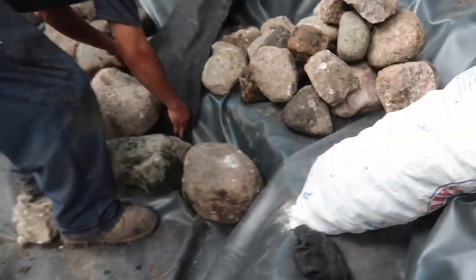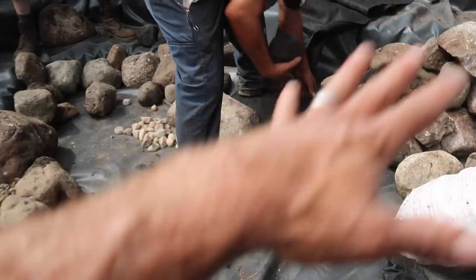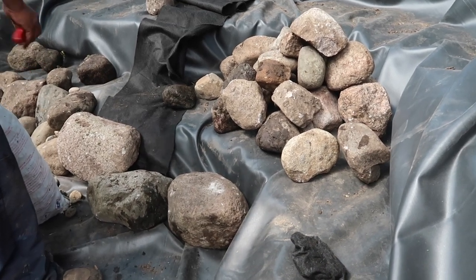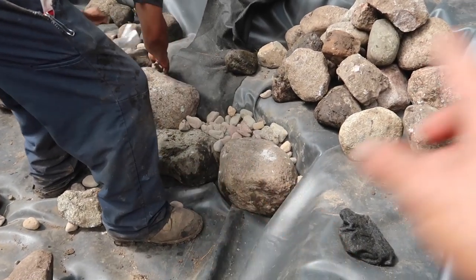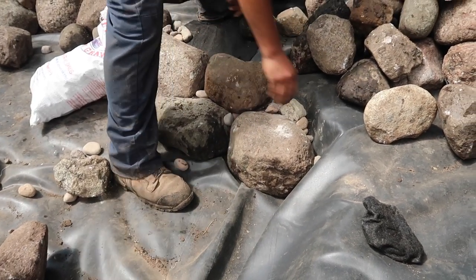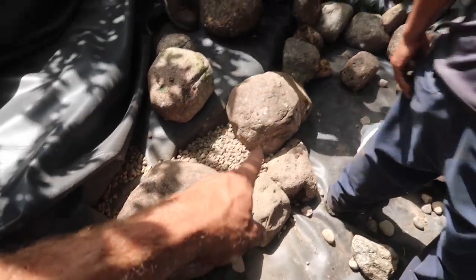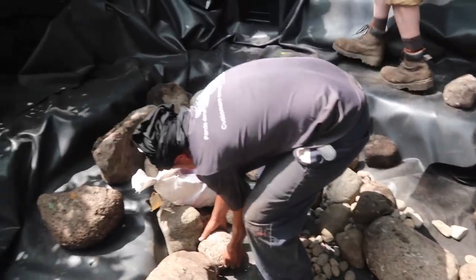What Juan's doing right now is actually a very super important part — rocking this bottom shelf. Think of this as the foundation for the rest of your pond, folks. If this thing crumbles, then everything up above it crumbles. Every rock dictates what the next rock's going to do. We can't stack them right on top of each other — it wouldn't be functional and there would be no stability. He'll kind of bump out a little bit, and then use some cobbles to go back behind that rock just to finish this shelf off. Rock in the bottom, then the next shelf up, then the next shelf up after that. Also super important is to change up the size of the rocks — you don't want it to look too regular. We always talk about that pearl necklace look. We just want to make it look natural, break it up. It adds so much more support to the design.